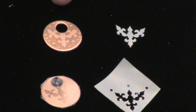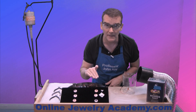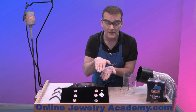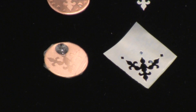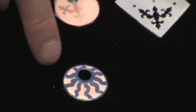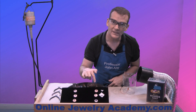Over here I've prepared a piece for etching by cutting a piece of contact paper using the paper punch and applied it onto the surface, with the back side also protected. What's going to happen is I'll get my design pattern as the raised surface and the background will be etched away a little further. With the other half of the contact paper applied to another piece, I'll get just the opposite — a nice flat area with the pattern etched into it. Finally, this last one I've painted a radial sunburst using blue enamel paint, and it's also protected on the edges and the back.